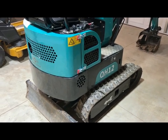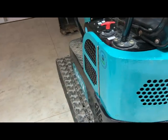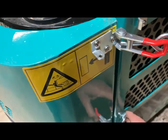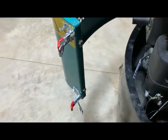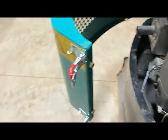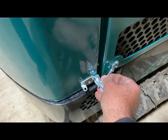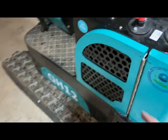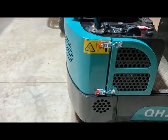End of the day, wrapping it up. Got the latches on, got the piano hinge on. One thing - I put the bolts back in backwards, the bolts that went into those slots. The reason I did that was because I wanted a similar gap over here as the hinge created over here. When I put these on, I put a spacer under the door to bring it up so it's equal to the other side.